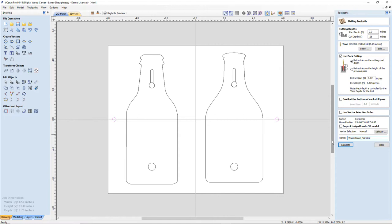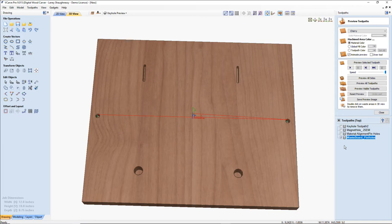If I create that toolpath, then because I'm working off a center, I could carve those two holes anywhere on my table. If I didn't want to carve them right where I do all my main carving, I could carve them anywhere on my table, then flip that board, mount it, and just zero out on the center of it. But I'm going to do it in the same area, though it gives us the opportunity to do it later.